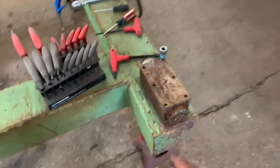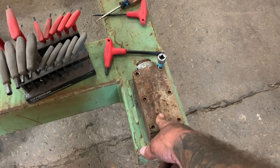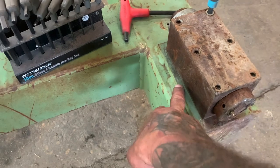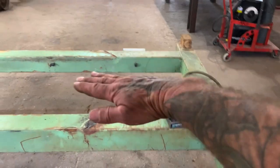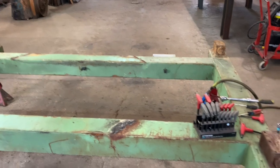What I'm doing right now is taking these big solenoids — or whatever these are — popping them off and throwing them in the metal pile. It's got these half-inch pads. I'm going to grind those smooth so I can sit the legs on top and then weld them up, get them nice and level, square, and plumb. Then I'll have it upside down and flip the table over like this. It should work out pretty good.